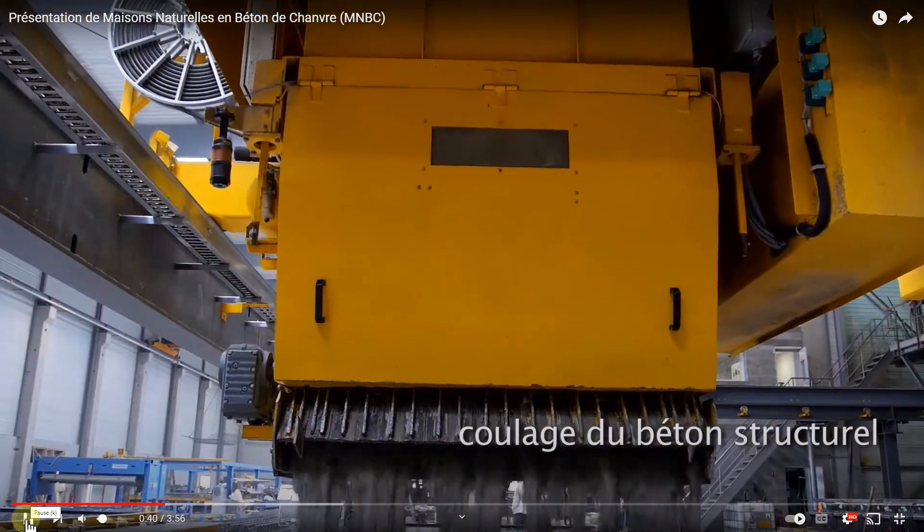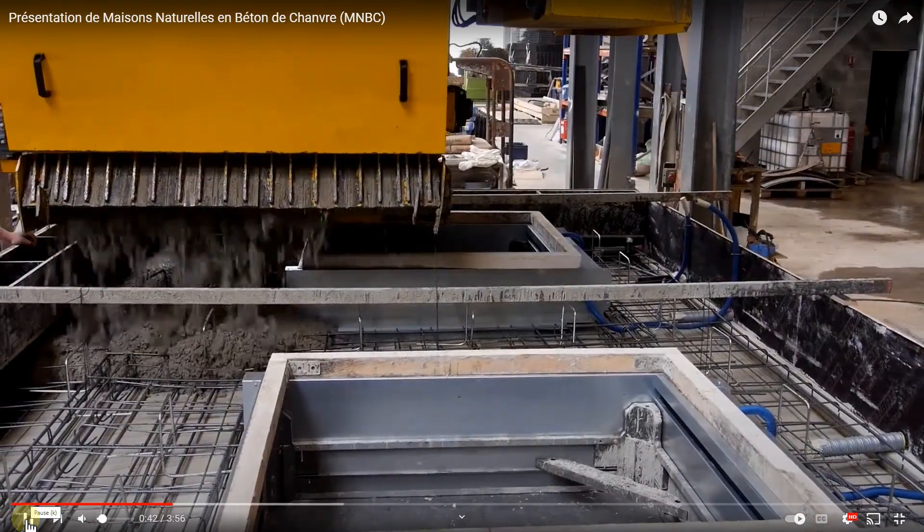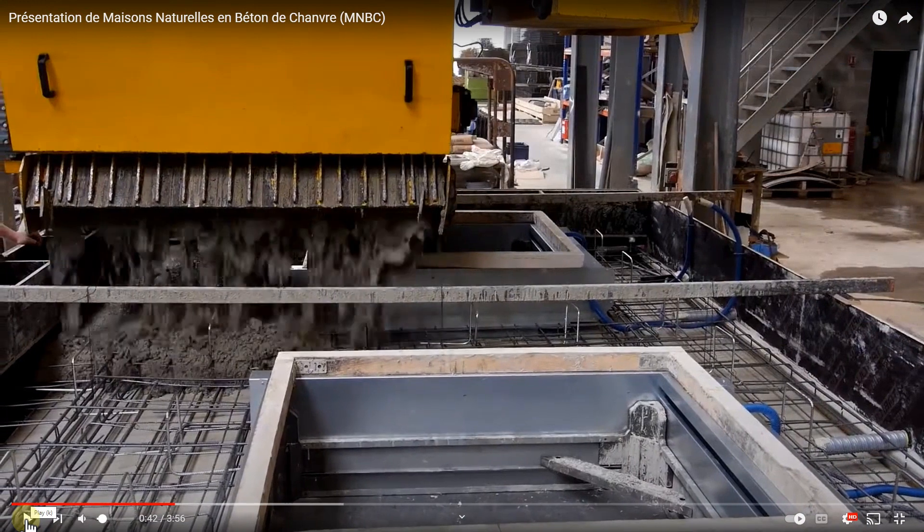You can see that the rebar in the bottom is black — that's just concrete. You can see the hooks coming up that will be set into the concrete but reach into the hempcrete; those are coated. They have definitely been hot-dipped with a particular coating, so there's no alkali reaction issue.